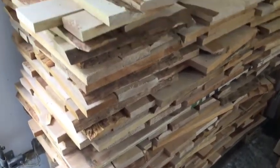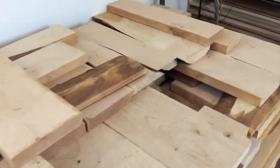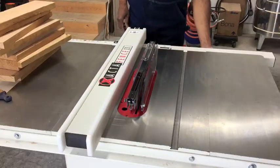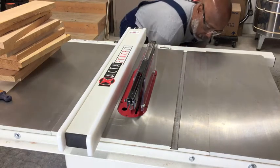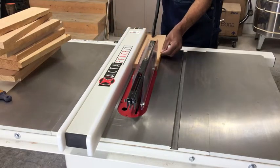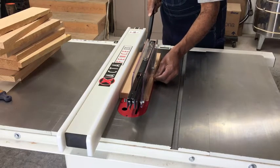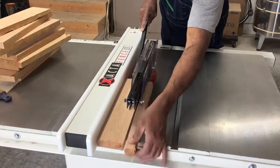The project started with a visit to my firewood pile. I got some scrap alder boards from the local lumber yard and selected some boards to get started. I began by ripping them down to three and a quarter inches, then down to three inches — my final width. My riving knife and blade protection equipment is in, and thank you to those who reminded me it's better to be safe than sorry. I try to use it as much as possible now.